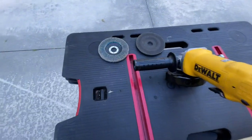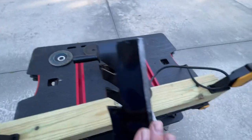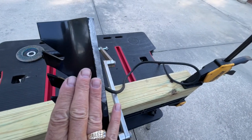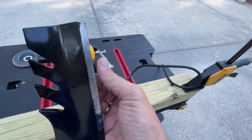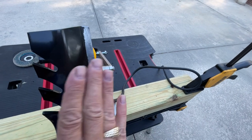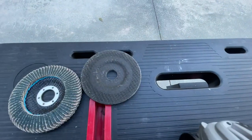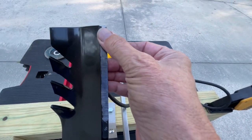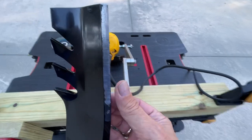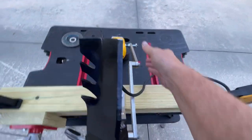When I first started sharpening, I used flapper discs and it put a convex curve to the blade — it bulged out a little bit and put a sharp edge on it, but had that convex finish. So I switched to the actual grinding discs and got a much flatter finish on the blade. These All-American Sharpeners are absolutely very consistent.